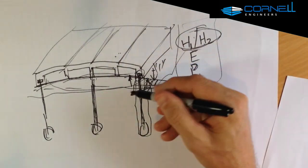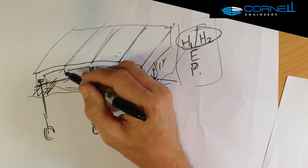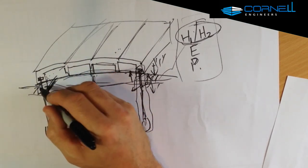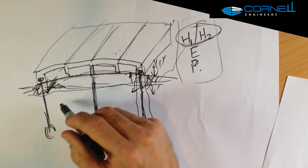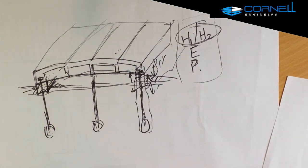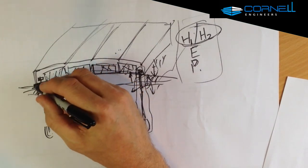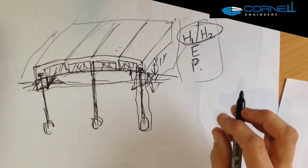My overall preference is that whether it's a raft foundation dug into the ground or a waffle slab system, I really recommend a merged system where the waffle system ends up having a strip footing around the outside perimeter that actually goes below ground level — to give the building a little bit of lateral stability. By all means have a screw pier that takes the support of the building down into firm soil at depth, but by having this combined system with a little bit of footing into the ground, I think we can achieve a much better result. The internal footings can still be on polystyrene void formers if you wish. This merged system would also solve some of the other issues with drainage and water getting in underneath waffle pod systems.